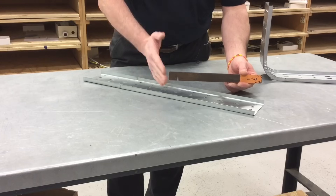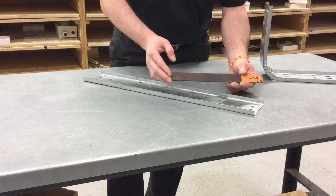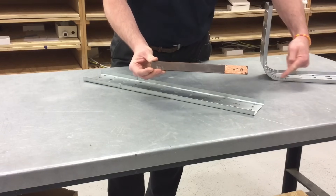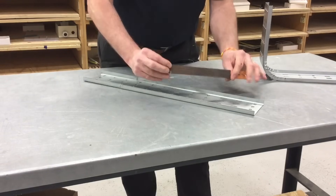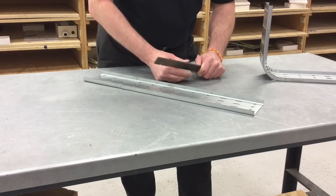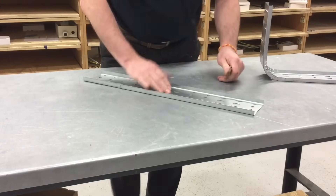So I'm going to take my homemade bar — a piece of metal with a slot cut in it. It could be a large screwdriver you no longer need with a groove put in one end of the shaft. Either way, I've got a groove in a piece of metal to use as a lever in order to put the crimp section into the cable tray, similar to the crimp produced on an internal 90 degree bend. The advantage of doing it yourself is that you can make the bend considerably more gradual, or alternatively quite a severe tight bend, depending on the bending radius required by the cables being laid on the tray.